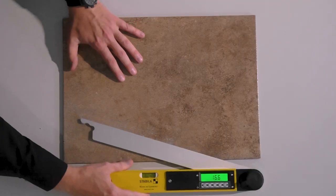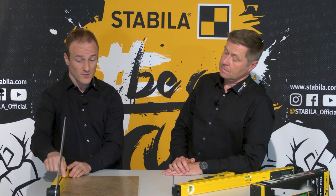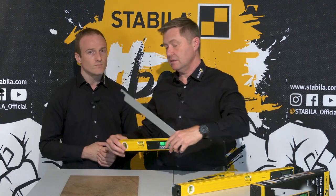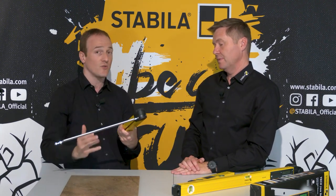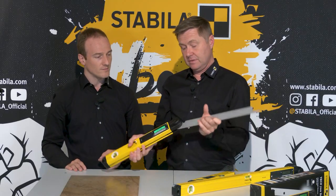With the TEC 700DA we have the contact edge, so it's very easy and I don't need high force to hold it — and it doesn't move. This gives you the possibility to put on the angle finder neatly at the front as well as at the back, because of the two contact edges. This is not only more comfortable but also much more accurate and safe because you cannot accidentally slip. Another advantage: in contrast to many conventional angle finders, we have an extremely large opening angle of up to 270 degrees — normally they stop at around 180 degrees. Very versatile.